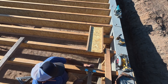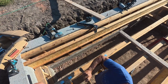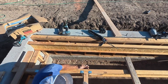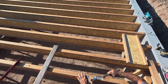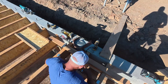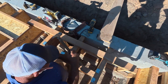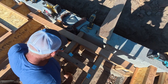We are just sticking a toenail on each one of these joists. One toenail should hold them all right in the place where we need them. Until the sheeting is on, that will keep them permanently in place. Now we are just throwing on the hangers for those two joists that we just cut — they are going to hang off of those ones we just set in.